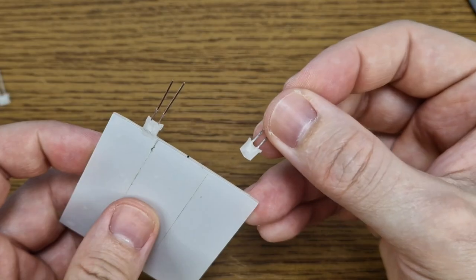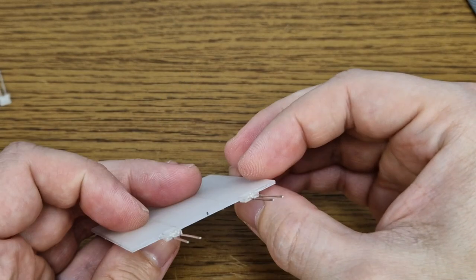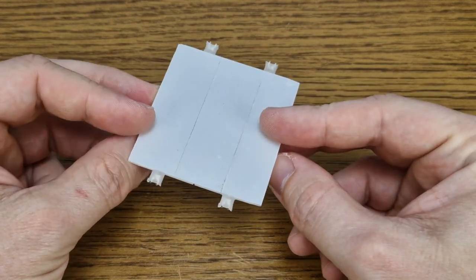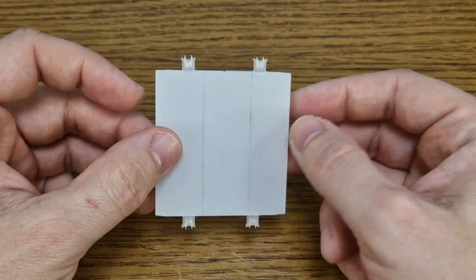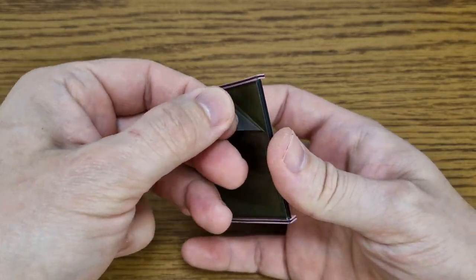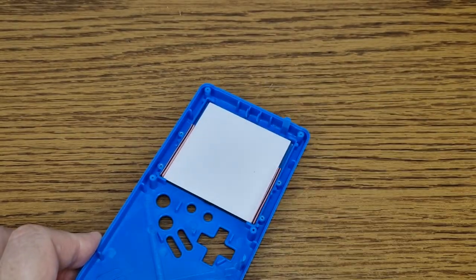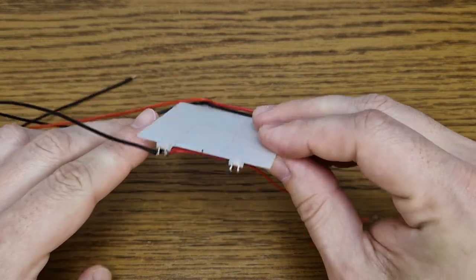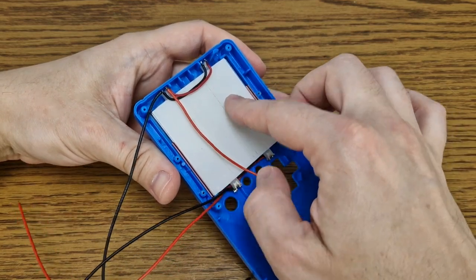I will cut the excess tape to the sides of the panel. The modified LEDs will be fixed to the side of the panel with super glue. After 1 hour the glue is dried. The LED pins also need to be cut because there isn't enough space. Now I can remove the protective film and start putting everything back together. I soldered some thin flexible wires to the LEDs, and bent them in such a way that would allow me to place the panel in position.